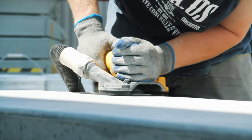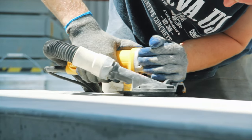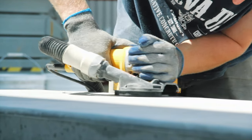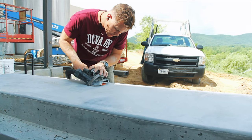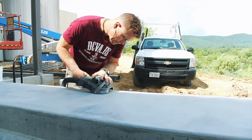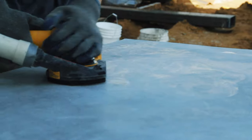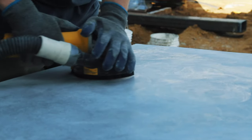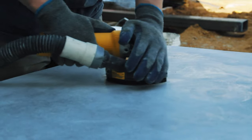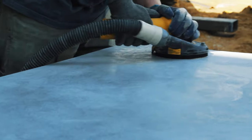For those that don't know, when you take a cup wheel — a metal bonded cup wheel — it wants to chatter on you. Chatter meaning it wants to bounce on uneven surfaces; it's spinning really fast and when you sit it down it tries to wobble. Especially when a tabletop is just troweled by hand and not perfectly flat, it's wavy. You're trying to hold this grinder as it chatters while going through 30/40 grit bonded diamonds on the bottom of a hand grinder. It's rough.